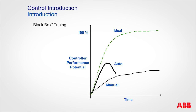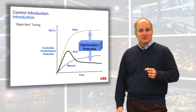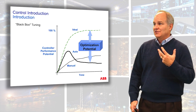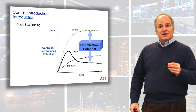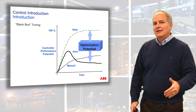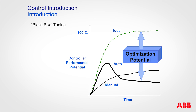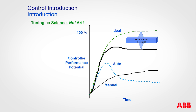So what's happening with these million-dollar control systems when we just turn them on and leave them as a black box? We result in what's called an optimization potential. That gap corresponds to ROI — it matches fiber usage, raw material usage, steam usage, whatever your raw material is. The more variability you have, the worse your production quality and throughput will be. That's what we're going after with this particular module. By understanding concepts like what is a model, what is a gain, what is a time constant, your understanding improves and you start to climb up the ladder until you can remove the performance gap.